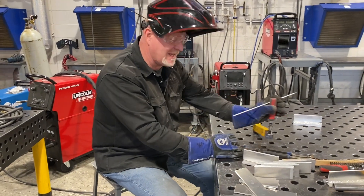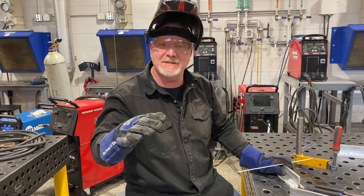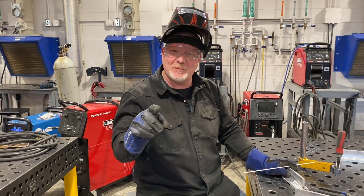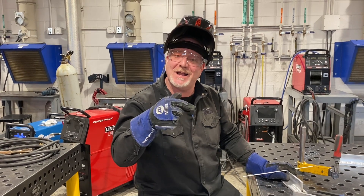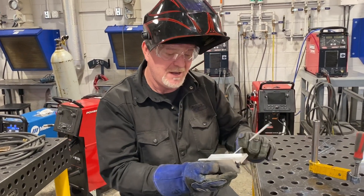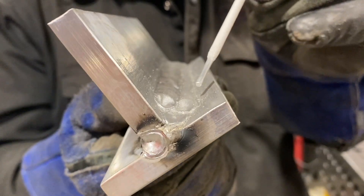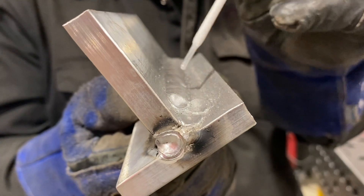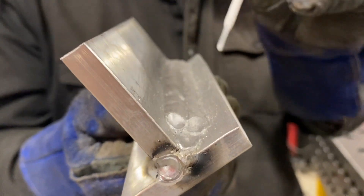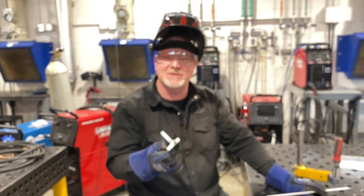So we got the third one in. Whether you're MIG welding or stick welding, when you're doing horizontal weld joints the whole idea is to keep that weld up in the joint so it's forming a triangle. Most of your horizontal welds fall to the bottom because of gravity and you're not compensating with angles. If you look at it, you can see it's sitting pretty doggone flat in the joint. There's the first one fused into the base metal, the second one fused into the base metal and halfway into the first one, and the last one is fused into the second weld bead and the base metal. The toes are all washed in, and I would guess that's a pretty competent weld — if we cut that apart to see what kind of fusion we have to the root, it's going to be nice.